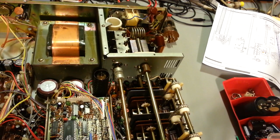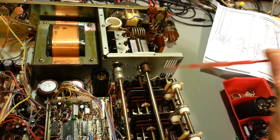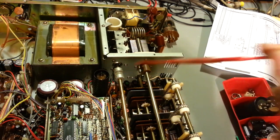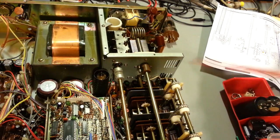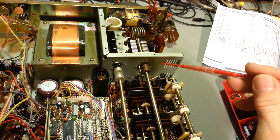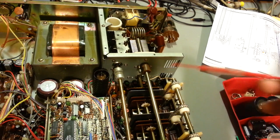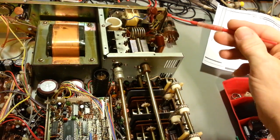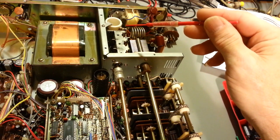And if anybody else ever gets a radio where somebody took out a broken coupler, moved it up here, moved the good coupler down there, and then didn't get it reassembled right, this is the easy way to find out. Like I say, just disconnect 3 parts. You can hook up a capacitance meter here.